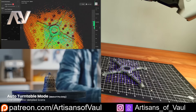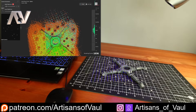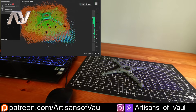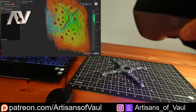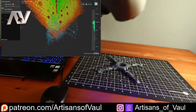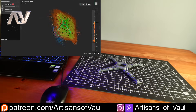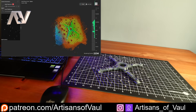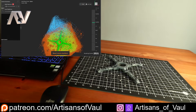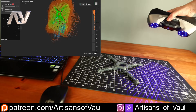On the Pro version, you can use turntable mode, which helps if it's not easy to manoeuvre all the way around the object you're scanning. You need to make sure you're seeing five of those marker dots at the same time, otherwise it will lose tracking. I've put them closer than recommended just to ensure five are always in view. They say five to six centimetres apart is normally fine for a larger object, but this isn't a larger object. You get quite a few marker sheets in with the scanner — about five or six — but they are an expendable, so bear in mind you'll need more eventually. The full-field view on the Pro version doesn't need any markers at all, which is a definite benefit.